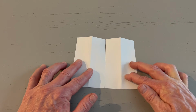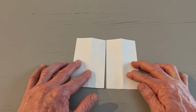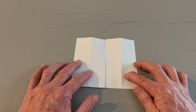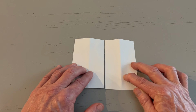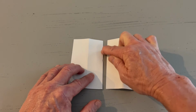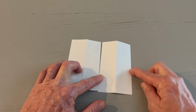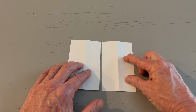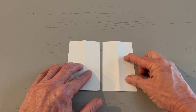But what if they just hit in the middle and they just don't close? These things have to have a gap when they're fully closed, or it's going to be problematic. If you have to shove them, force them, it's not going to work. So what if you've done that and you've moved these things over as far as you can, but you just don't have the room? Don't plane these edges. Take the door off, plane this edge, and then move it back over. And if it's a big gap, plane both doors. But if it's just a little, just plane one door at a time and see if you can get it to work.